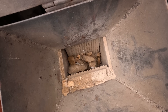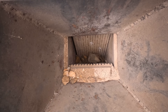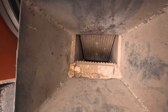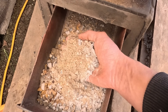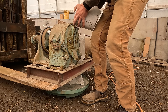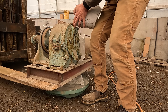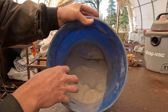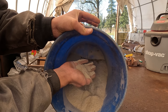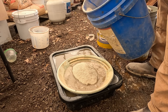We're going to start here with this little 4x6 laboratory jaw crusher — feed the rocks down the jaws and they come out in this tray here, crushed. Then we'll run them through the fine crusher. After going through the pulverizer, a lot of the gold has been liberated — it's been broken away from the quartz. Now we can pan it out; it's going to take me two or three pans to get all this stuff panned out.